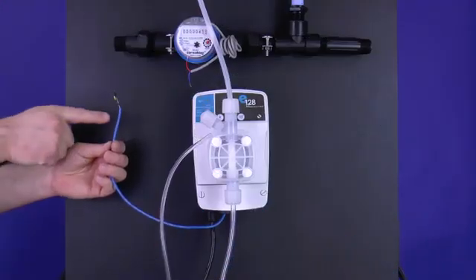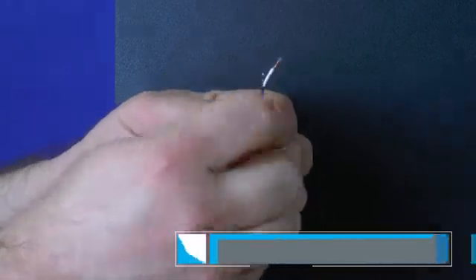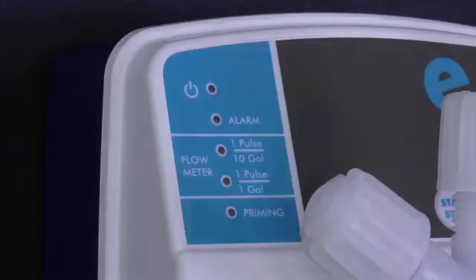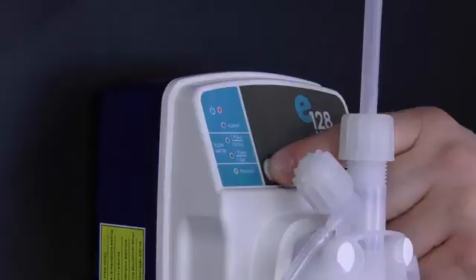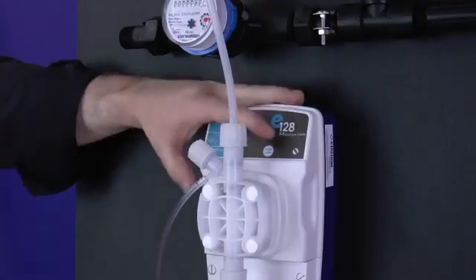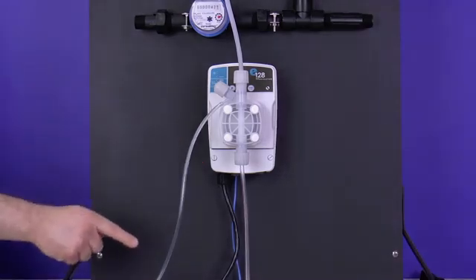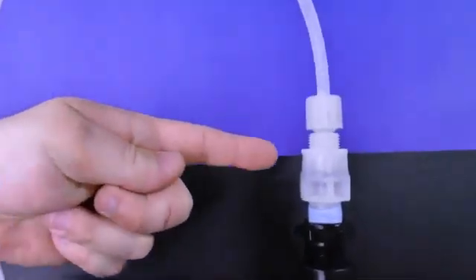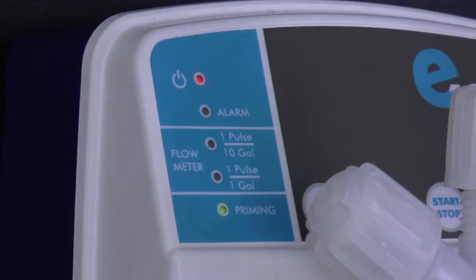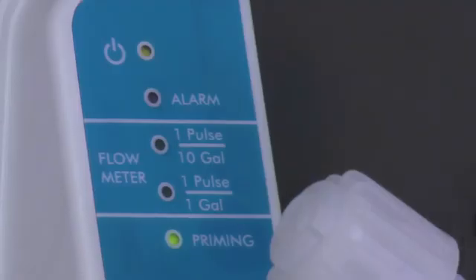Initial setup and priming. Locate the E128 Medicator blue lead wires as well as the water meter lead wires and connect the two sets of wires together. Polarity typically does not matter, but if it does, the E128 white wire is positive. Connect the E128 Medicator to the power supply — the power LED will light up red and the pump is now in standby mode. Press the F (function) button a couple of times until the priming LED lights up green. Open the air bleed valve on the top left of the pump head and press the start/stop button. The E128 should start stroking and chemical should start coming up the suction tube. Once chemical starts going down the bleed-off tube, close the air bleed valve. Chemical should now go up the discharge tube and into the injection valve. When the priming process completes, the E128 Medicator stops stroking and the power LED lights up green — the pump is now in setup mode. Press the start/stop button once more and the E128 is in standby mode.